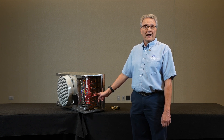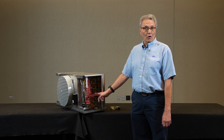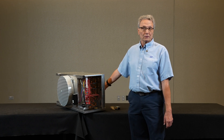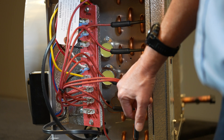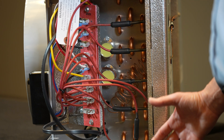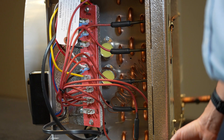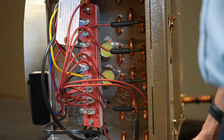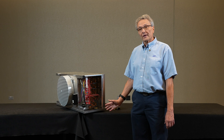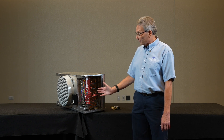When that happens, we don't want to bring the fans on immediately because the evaporator is saturated with moisture. So this three-way switch also has a fan delay that allows the evaporator to pre-chill back down to evaporator temperature — basically re-freezing it.